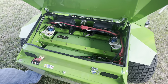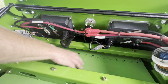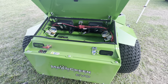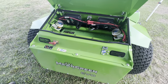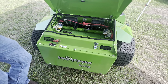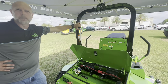On the EVO — the 74-inch model — the rear compartment is opened up to show the fan motors, the left and right wheel motor controllers, and the battery sitting low between the drive motors. The battery itself costs approximately fifteen thousand dollars. However, with 13 individual cells inside, they can plug into the battery management system, identify a bad cell, and replace just that one cell for around a thousand dollars rather than replacing the whole battery. The batteries are tested to 8,000 hours and still hold 90% capacity at that mark.